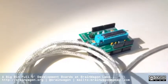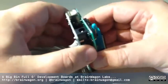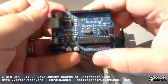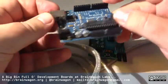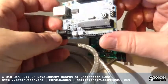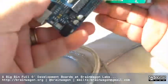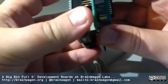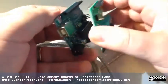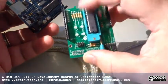There's quite a variety of different boards, and there's one that probably a lot of people are familiar with. This is an Arduino, which is carrying a shield. This is the classic Arduino — a little sticky to get apart because I didn't do a great job of soldering. It has an ATmega 328, and this is sort of the granddaddy. It does have the 328, which has 32K of memory, and it uses the old classic USB port. This shield here is an in-circuit programming board to program more ATmega 328s.